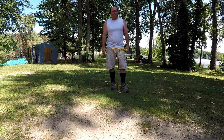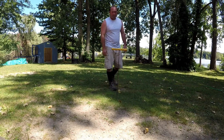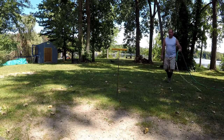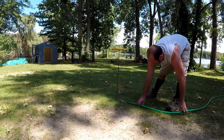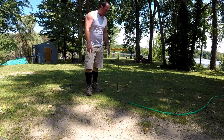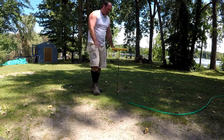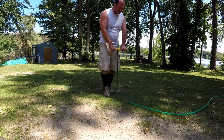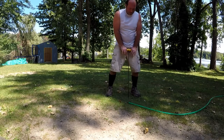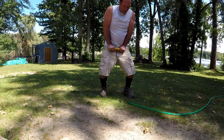We can go in the basement and check where the line comes out of the house to make sure we have a good proper starting point. Then just take the hose and let it start soaking the ground — let it go for 30, 40, 50 seconds. We are going to find that the water starts running down the hill, so start by making some holes. That will let the water get into the ground instead of just running over the top and down the hill.